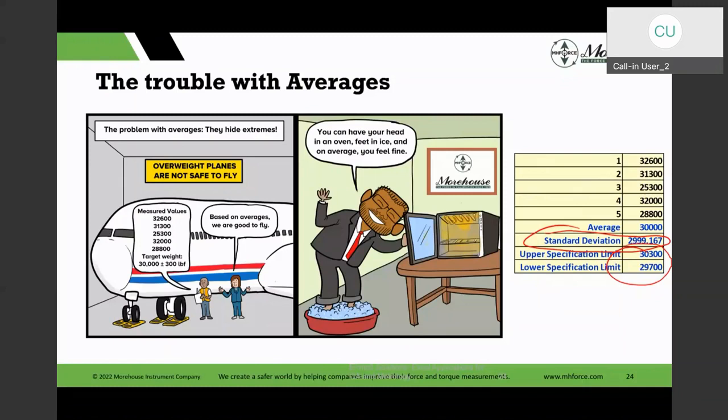Now you're only taking 2 measurements and an average, and I have to respond to that question. I said, what is the right thing to do? There are other things we talk about in measurement uncertainty, but a lot of times the luxury you have is only making 2 measurements. 2 measurements are better than 1, but it still has a dilemma like this. Here we have 5 measurements, and the average is perfect, it is 30,000, but the variance associated with that is 3,000, and that's not good, because now we have quite a high error.